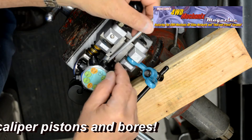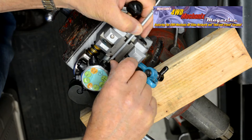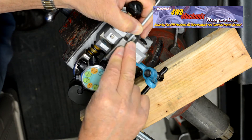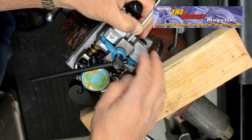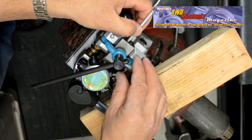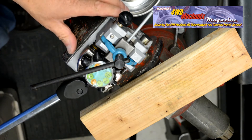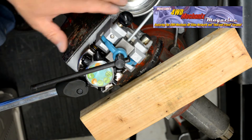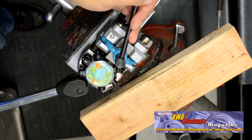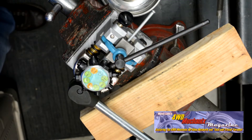This flaring tool uses a split pair of dies. The channel in the dies is smooth. This particular type of die setup is least damaging to the tubing. The first step in this flaring operation is to square off the tube with the end of the die and make sure the die halves are square with the fixture. The flat punch squares up the tubing with the end of the die and squares the die with the fixture. The bridge screw can now be tightened to secure the die halves to the fixture. Good and snug is plenty tight.